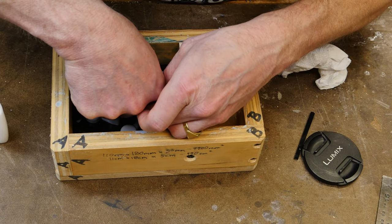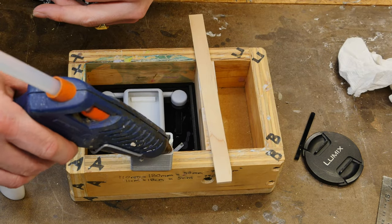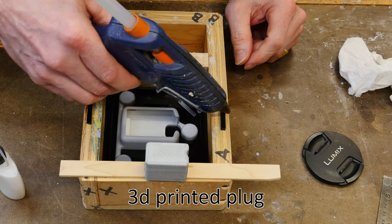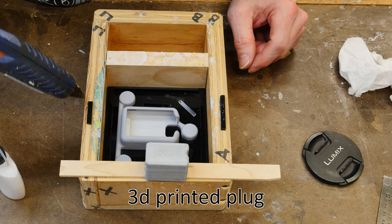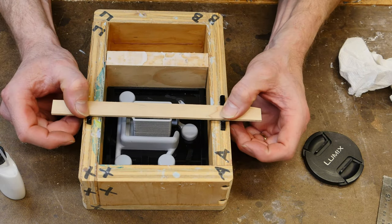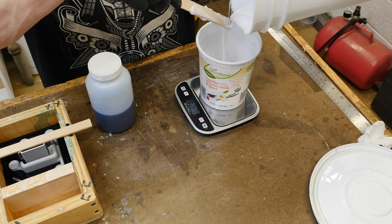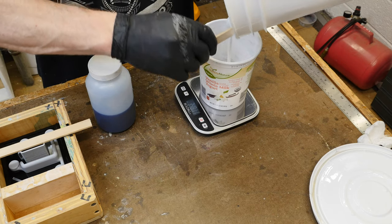We have to guard against some electrical contacts that need to be exposed in the final piece. I also have this SLA part that we're going to glue in place with some white glue, and there's going to be a plug. Since this part is pretty deep and has some undercuts, we'll put a plug in that can be removed later — that'll make the silicone more flexible when we go to remove our parts.